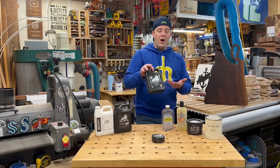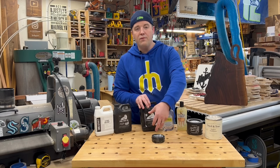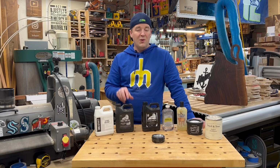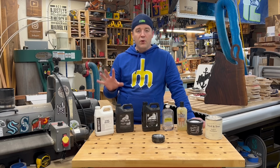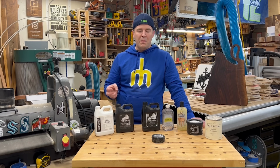Walrus Oil makes a cutting board oil that has mineral oil and other waxes built in, and then you finish with the wax. One other option is tung oil. So pure tung oil, mix it with a citrus solvent. Walrus Oil now actually has their own solvent, food grade. These are all food grade materials where you can mix it, deeper penetration.